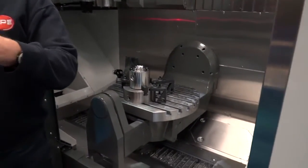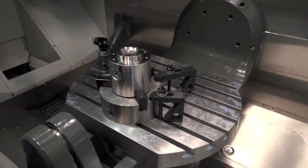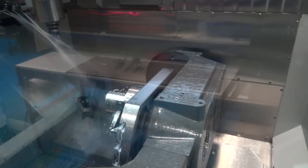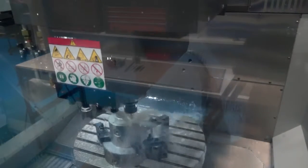The second thing you mentioned before the interview is the dynamic work setting — how does that work? This machine has dynamic work setting on it. To do a particular job on standard machines you'd have to do two separate setups, and every setup is a chance of an error creeping in between the datums. But on this machine you have one setup, one datum, and as the machine moves around to the different faces it automatically works all the figures out, taking away the error of multiple settings.